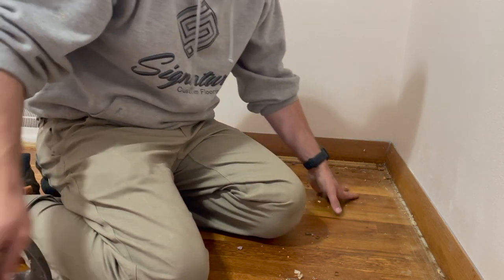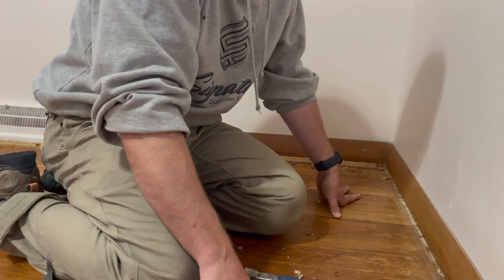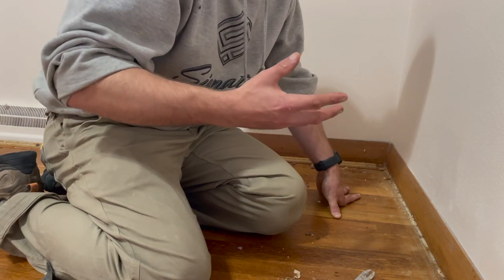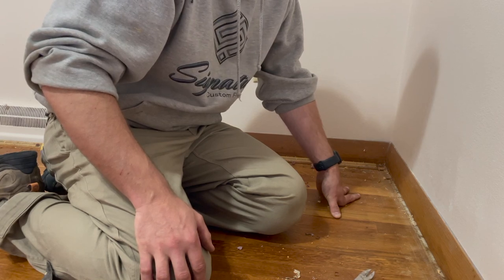That's kind of how you remove the tack strip without damaging any of the floor. That's the main thing — you don't want to dig in and take a big gouge out, because then you're going to have a spot with filler and no grain, and that's going to be quite noticeable. This is a great way and the right tools to use to not damage the hardwood floor so they're all ready for your hardwood floor refinisher. You can see all of the carpet is removed and that is what the final floor looks like. Hopefully these tips were helpful, and when you discover hardwood underneath, use these tips so your floors don't get damaged when removing the carpeting — and like and subscribe for more tips.